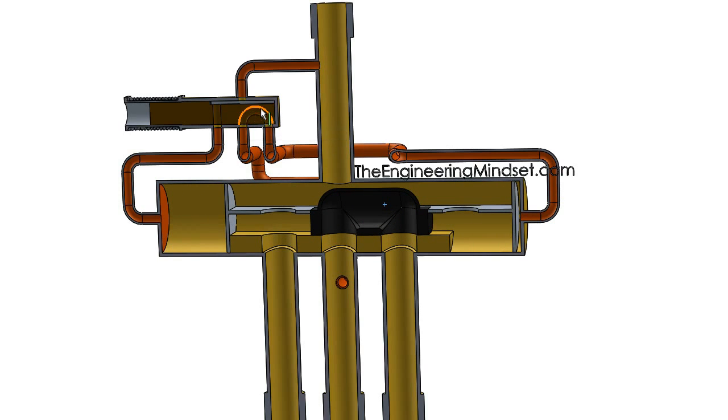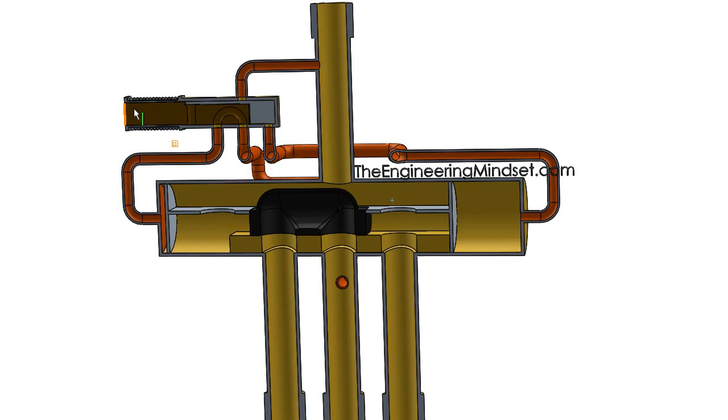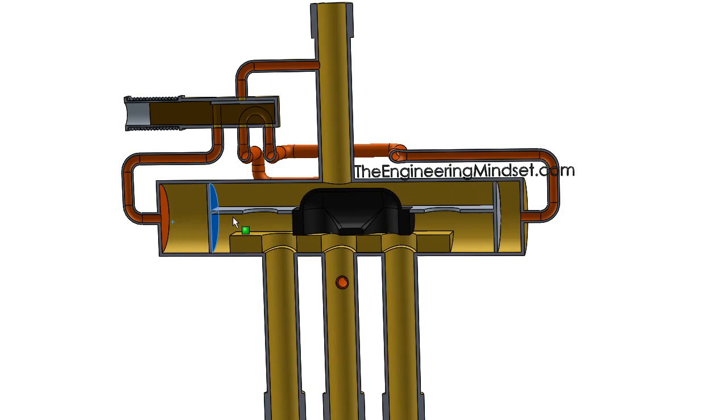To achieve that and push the slider along, we've also got another sliding valve up here. With high pressure coming in from the compressor, once this coil is energized it creates a magnetic field when an electric current passes through it. That pulls this valve across, making the high pressure refrigerant pass through, all the way through this valve and slide it over, allowing the refrigerant to move through. There is a little spring in here usually, so once de-energized and electricity is cut off, that valve is pushed automatically back to its default setting, allowing the high pressure refrigerant to enter and push against this side, sliding the valve body this way.